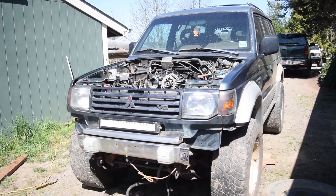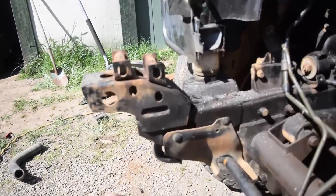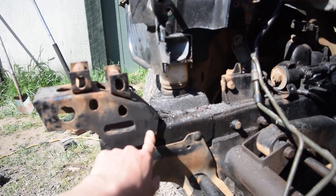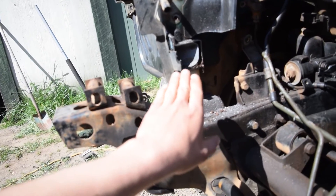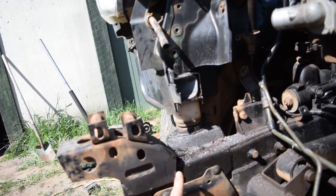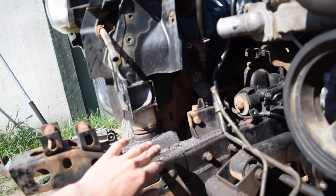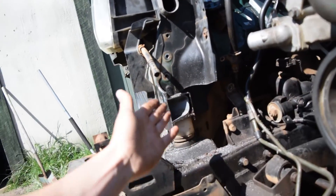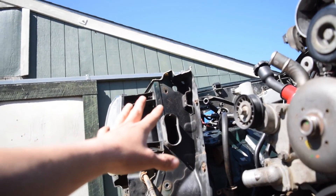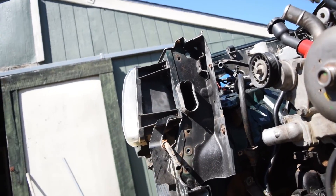Well, it is a super tight fit. Got the radiator in there mocked up with all the body panels. What I'm going to do now is trim off these pieces of the frame rail — I'm probably just going to cut straight down. Because I have to angle the radiator a little bit forward like that, this will give me a little bit more room in the back.